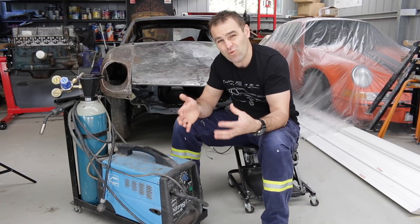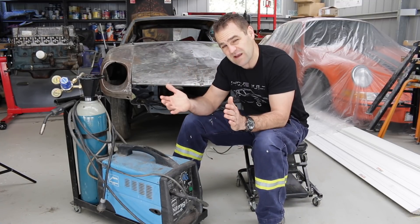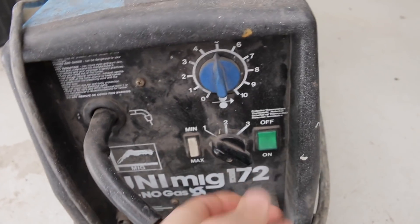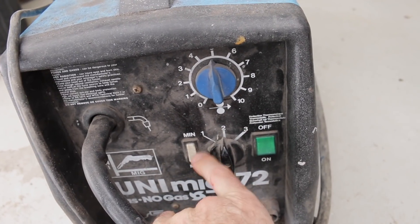This is a relatively simple one that still runs on my regular 240-volt power with a 15-amp outlet. It's adjustable for wire speed and also adjustable for six settings: one minimum/maximum, two minimum/maximum, three minimum/maximum.